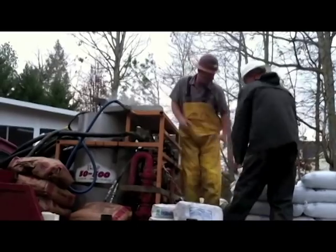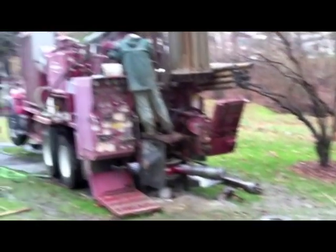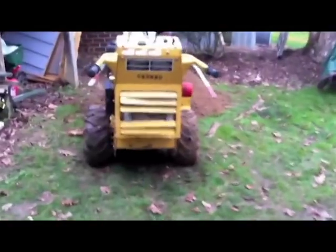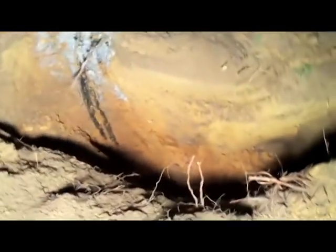After the installed loop, they backfill the hole with a mixture of bentonite grout and sand. This is the grout pump. The drilling does make a pretty big mess — this is basically ground-up granite rock and well cuttings. Here is where they are pumping grout back into the hole. After they were done, I rented a trencher so I could dig a trench about 3 feet deep from my crawl space out to the well.